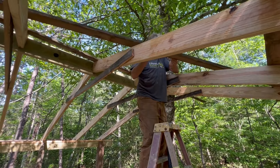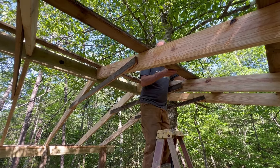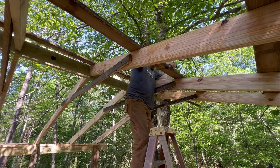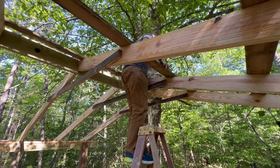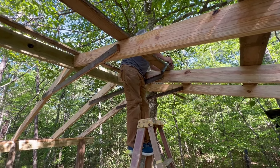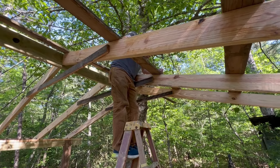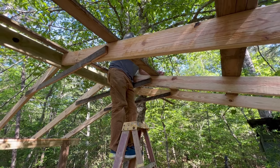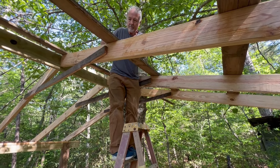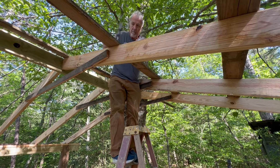The treehouse started out 16 feet wide, and then we have the little triangular parts that stick out. These boards are 16 foot, so I'm having to pull them back two rafter spaces from the end and waste some. They are shooting for a six-inch overhang but mostly have like a two-foot overhang, and I'm going to cut them off later. It's a little bit wasteful, but I didn't want any of the joints to end up in the same spot, and I didn't want any tails hanging out that weren't going back at least two rafters to keep them strong.